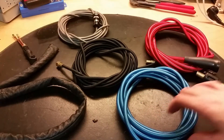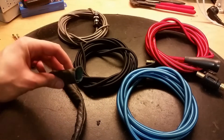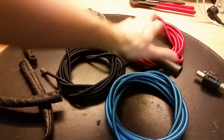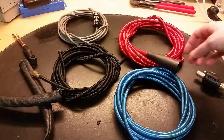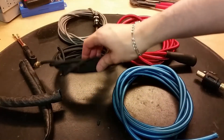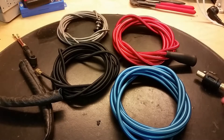Now I've tied it up a bit. We can see what we've got in a TIG hose. I'm going to keep these parts here — these are the good parts. This is some kind of leather I think, with pretty good resistance to heat. We've got three hoses, and this one is a cable as well. This one is much heavier than the blue one — there's some good copper in that one. I think this welder should handle about 200 amps, so this can be very thin for 200 amps, but when it's water cooled it can carry much more current. We've got this hose for gas, a water hose here, and some heat resistant cable. There's lots of good stuff in a TIG welding hose.